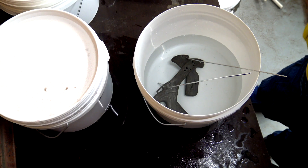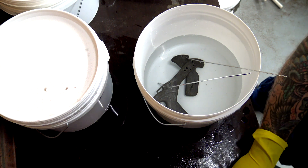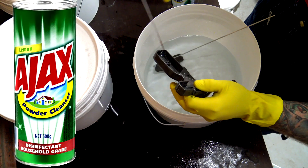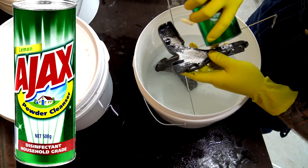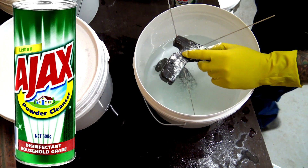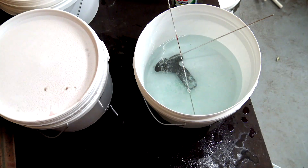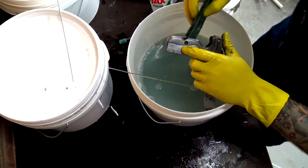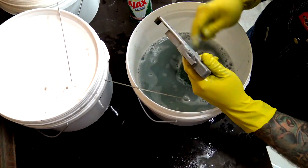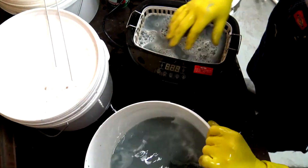The next step is to give the pieces a really good clean. Once you've got them down to bare aluminium, you just start cleaning them. I use the Ajax powder stuff — I'll show a photo of it here. Then I just get to scrubbing. I use gloves at this stage not to protect me from it, but to protect it from me so I don't get my dirty hand oils all over it. Once I get a really good scrub, I throw it through a session in the ultrasonic cleaner. This isn't necessarily all needed for a good result, but the better you take each step and the more effort you put in, the more likely you are to get consistently good results.